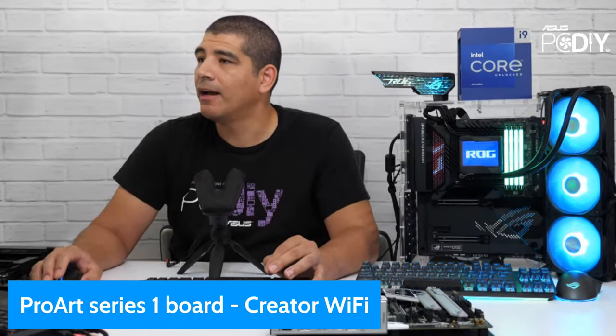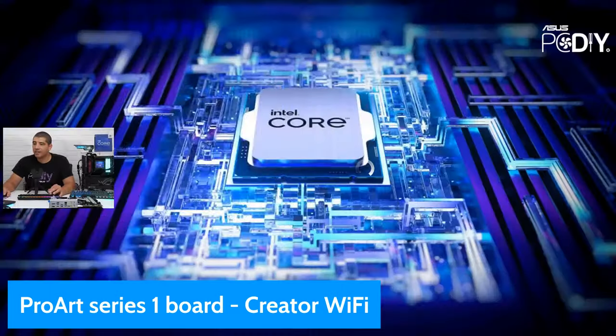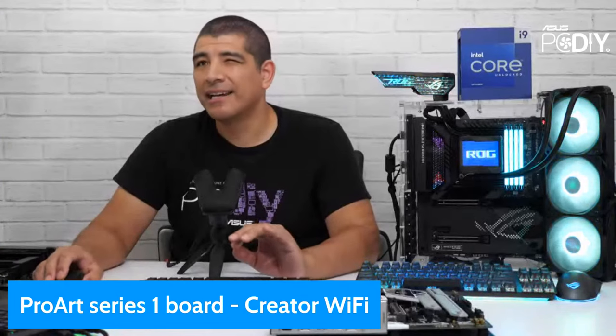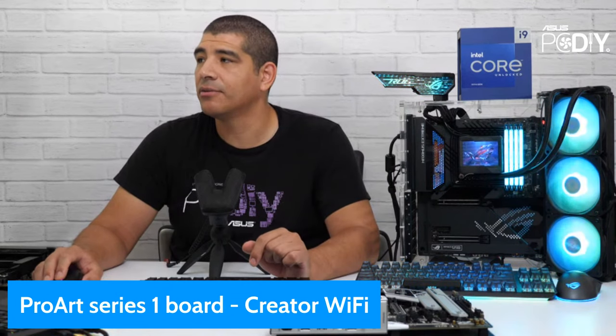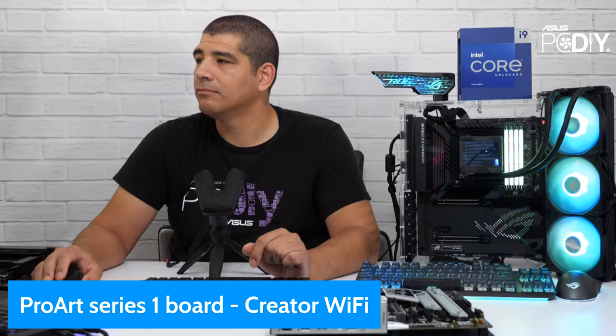All right. I'm going to go ahead and go a little bit closer on the board here. Again, to recap at a point right here, keep in mind that the actual expansion support on this board, right, you have PCI bifurcation support. So it's PCI Express Gen 5 right here. That's full x16, then x8, and then you have an x4 slot that's going to be present on there, right? So that is going to be one of the key differentiation points between this board and another motherboard when we talk about that PCI slot configuration. Okay. See right here.